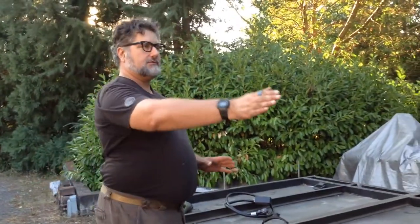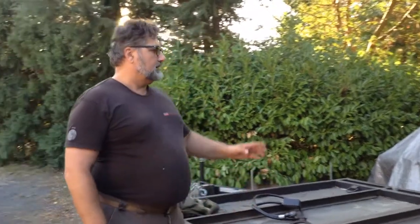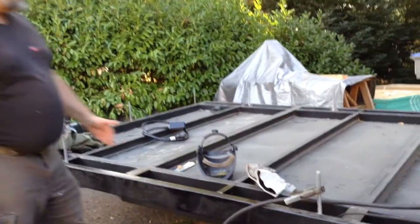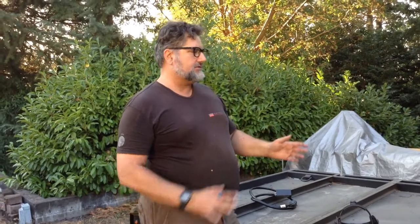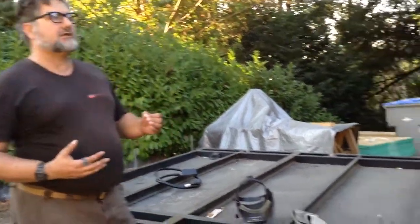What we're doing here is a tiny house build, and we can see on the trailer here — it's a heavy-duty trailer that's been modified with a frame outrigger situation, because a lot of the original Tumbleweed designs use something where the wheel wells end up on the outside of the trailer. On this, we're going to go over that in order to get as much interior space as we can.